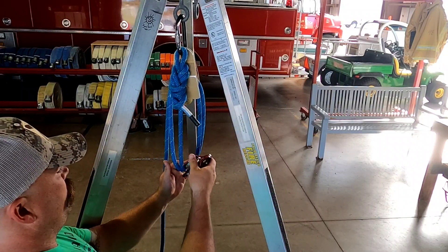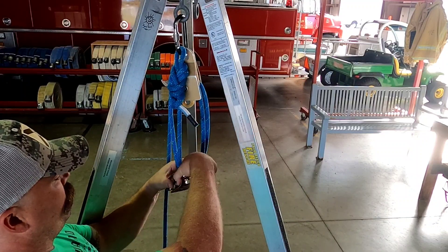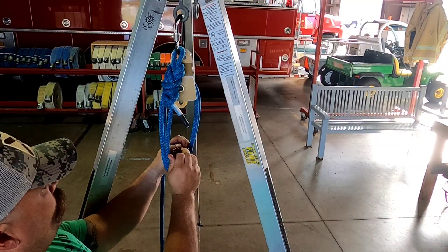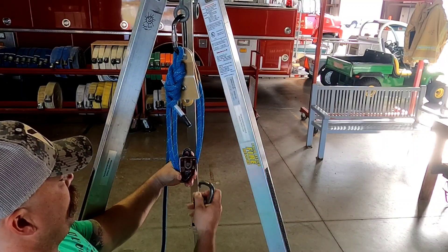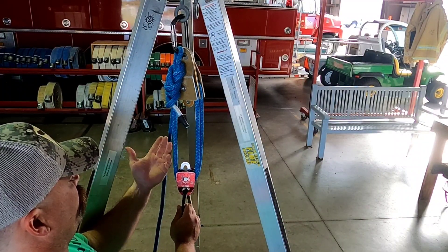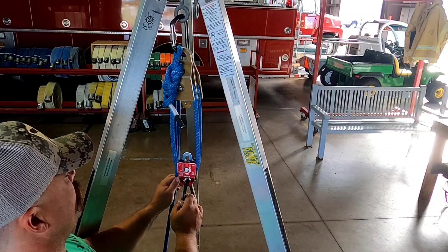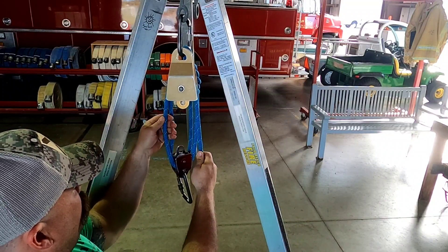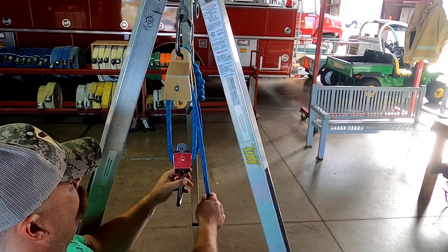I'll pull the bites down. To make rigging easier — a lot of people find this confusing — I'll drop the mid-plate down the center: open up both side plates, put the mid-plate down, split the two ropes with one away and one toward me. It just lays in there real nicely without fishing one rope at a time. I'll take my carabiner, close the pulley, and now I have the 4-to-1 — four ropes coming off my moving pulley.